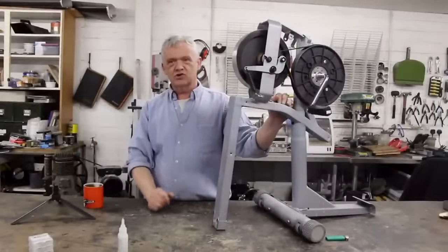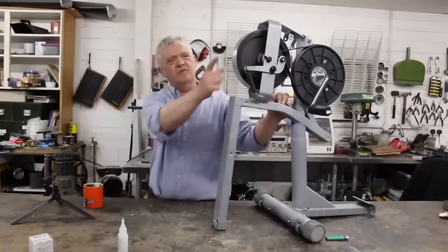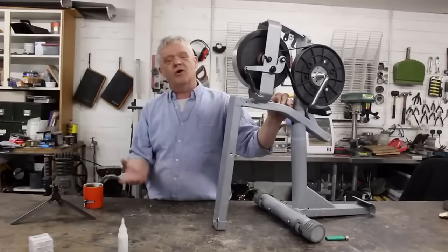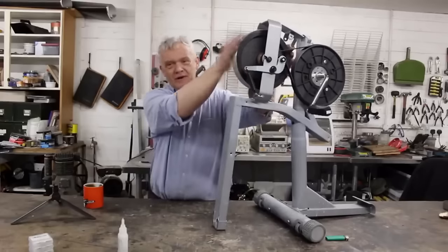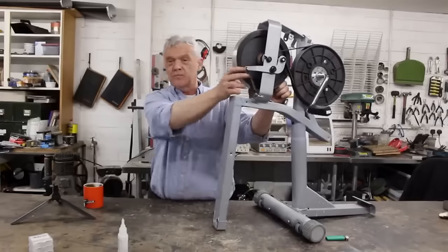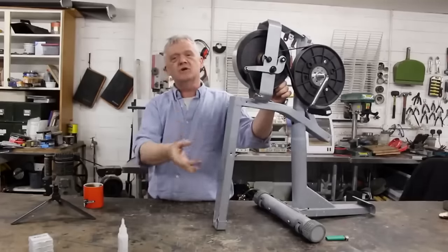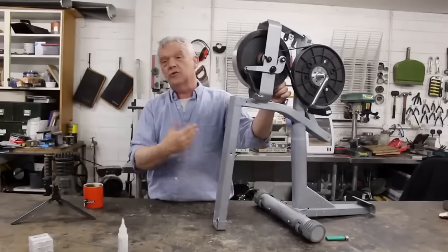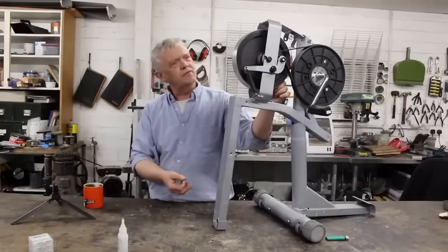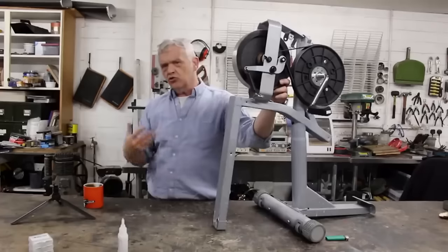We have a number of choices for the generation section. We can strap on an alternator and run it from the belt off here, but I favour making the flywheel into the generator. We've got this great big flywheel that turns quite quickly even for a slow hand speed, which is great. By missing out the belt we get a more efficient machine because we don't have the losses in transmission - a belt drive does lose energy through friction.